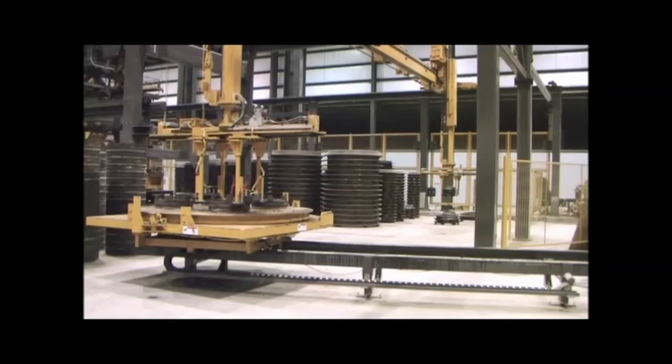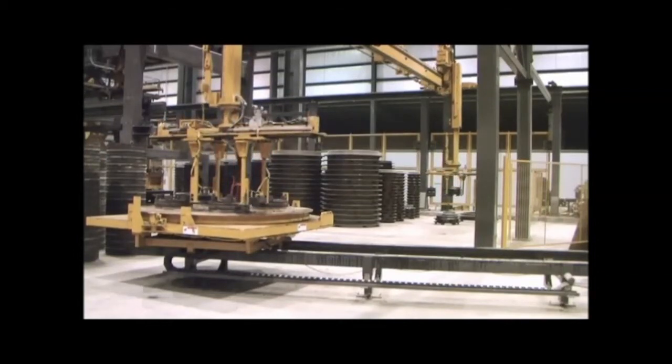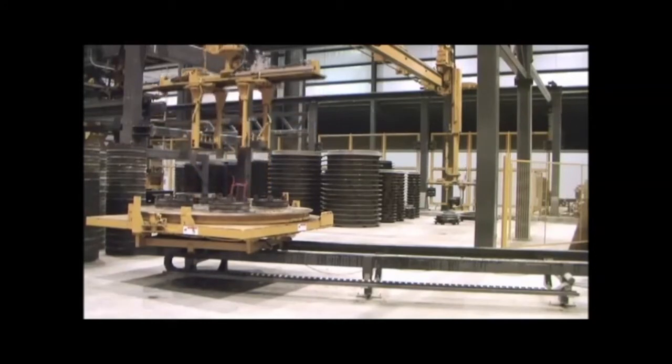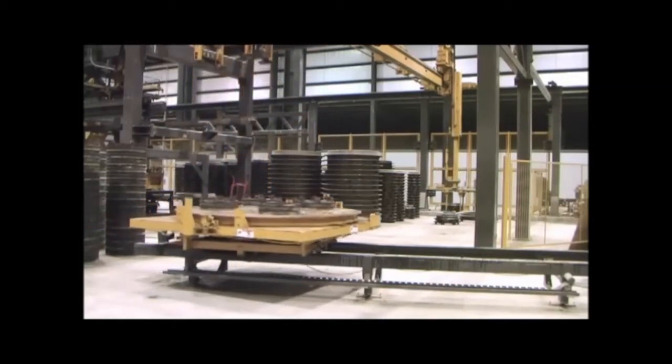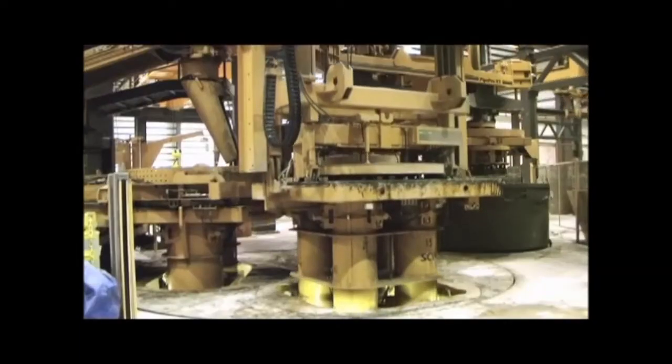At the third station, the header ring that forms the spigot joint is pressed down into the fresh concrete. This machine also automatically cleans each pallet and header ring after each use and stores them to be grabbed automatically when next needed.